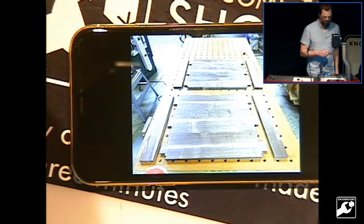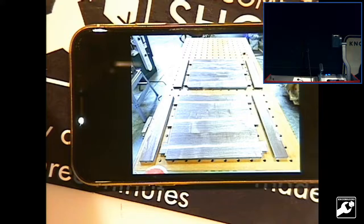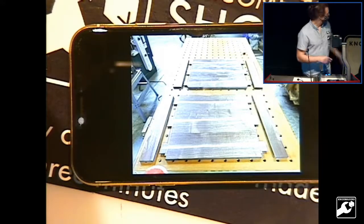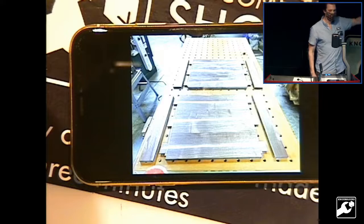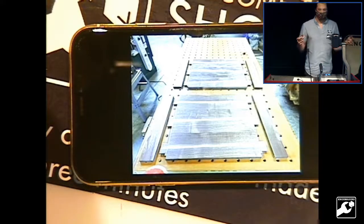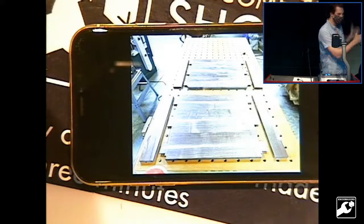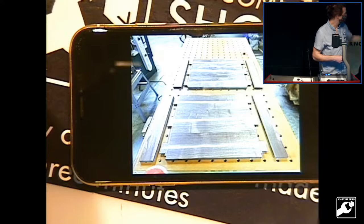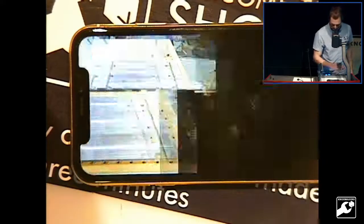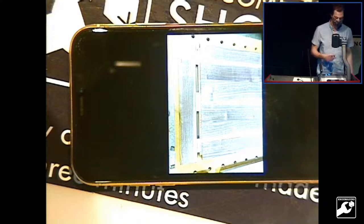So the idea behind this is you have this smaller area here that's called the haunch. That keeps everything in alignment. The pin in the center is the only one that gets glued. The ones on the outside are there just to add some more strength, and they're completely floating. So as the board expands and contracts with changing humidity and temperature, it'll hold it all together. So you can see how they slide on. Those are kind of cool, actually.